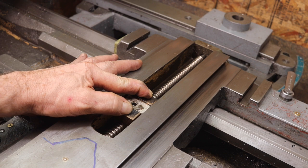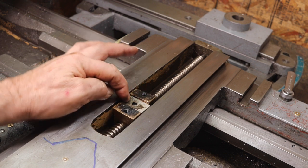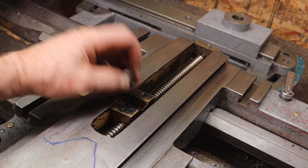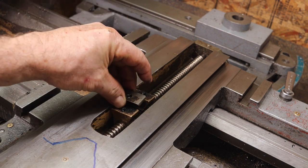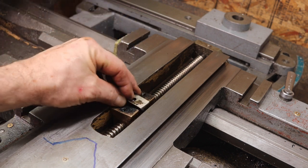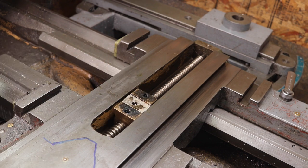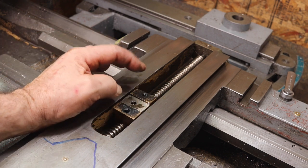Right now I'm holding it here and it's like zero. This is actually a pretty nice setup. If you wanted to do this to your own lathe, it wouldn't be a difficult thing to do — two nuts with some slopes on them so the wedge pushes on it, and you'd have to put holes in your cross slide. You could actually modify your own lathe to have this type of adjustable nut setup, and the setup actually works really well.